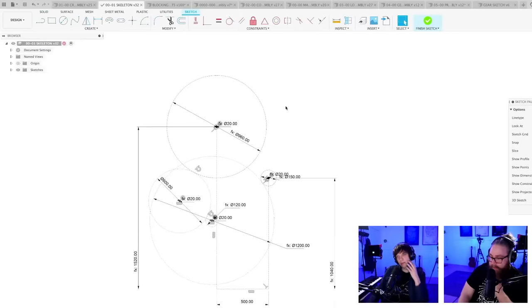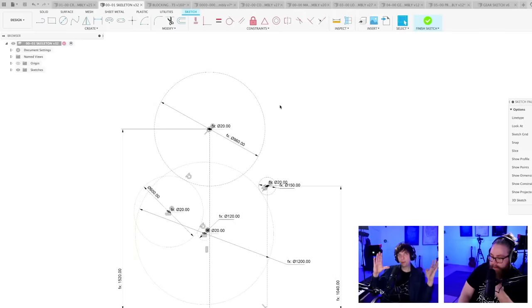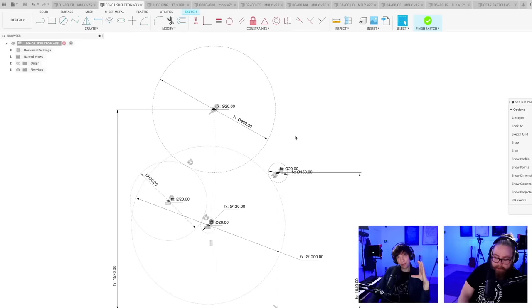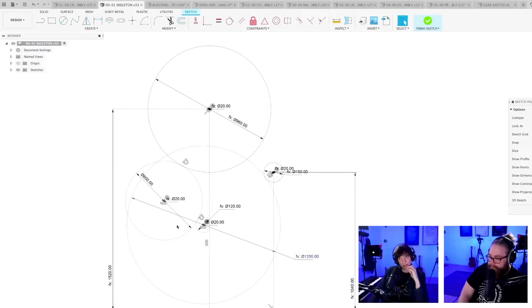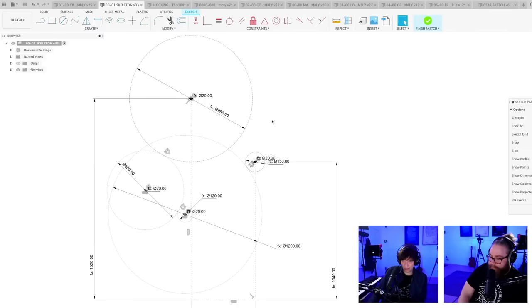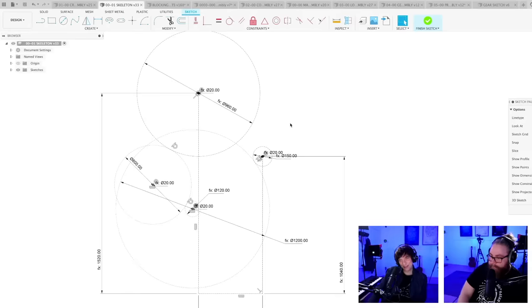So that's why I'm a little bit obsessed with driving the programming wheel on the outside as much as possible. You're right that we could drive it from the middle, like we're going to drive the flywheel from the middle. But in the flywheel, it's the opposite relationship. The outside rim will power the small middle. So because of leverage, I want to power it really on the outside rim if I can. Loving this discussion, so happy that you all want to have it, because it's really helping me think.